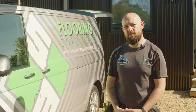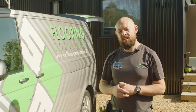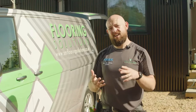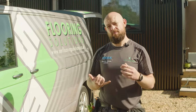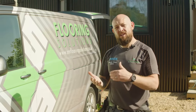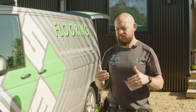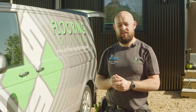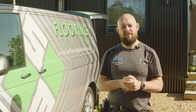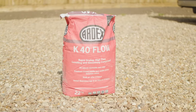I'm Shane from SM Flooring Solutions. We're collaborating together with Ardex for this next project. This project entails a lot of preparation. There is an anhydrite floor, so we'll be talking about how to prep an anhydrite floor ready for smoothing compound. We'll be grinding the floor with our Yancey Calibri grinding machines. Once we're happy with everything, we'll apply the Ardex primer, the new smoothing compound from Ardex, and then we'll be doing a herringbone design for this client.